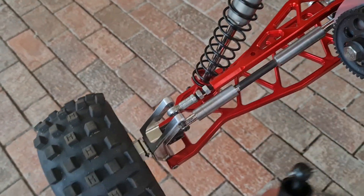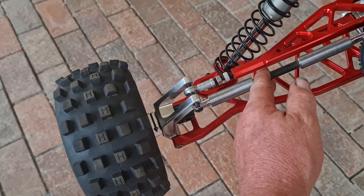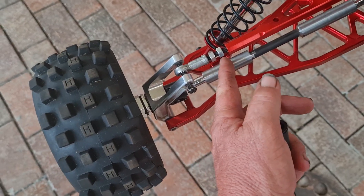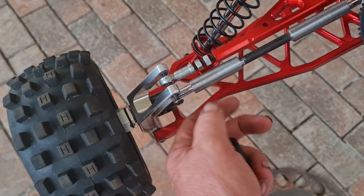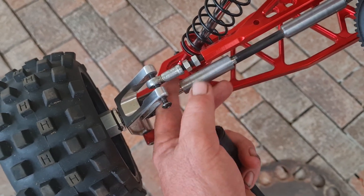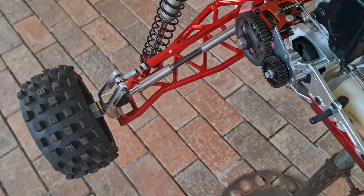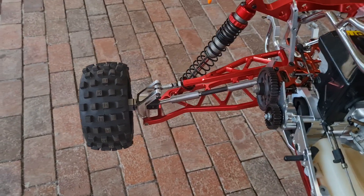I made it and joined it in two places, because these had been treated before. They're actually a sleeve I made up — 9mm inside diameter. I did split them, and when I did one half I actually welded two shafts inside, then put the other piece of the sleeve on and welded up the guts. The welds are along here and in the middle, not on the ends, because you'd weaken it there.